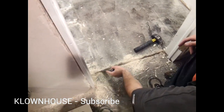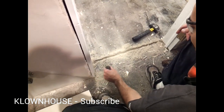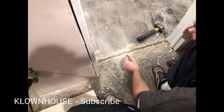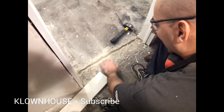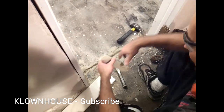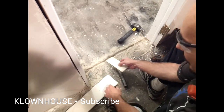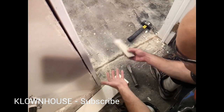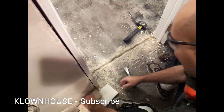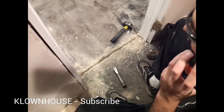I did a line here and also a line here. Now as I start to break this, it's going to come apart. What I'm doing here is I want to put this threshold down because I'm putting tiles in, so I want them to come flush together. I want to sink the fresh threshold down, and I also didn't want to cut the door. You can do either — cut the door or put the threshold down — there are different reasons why you could do this.